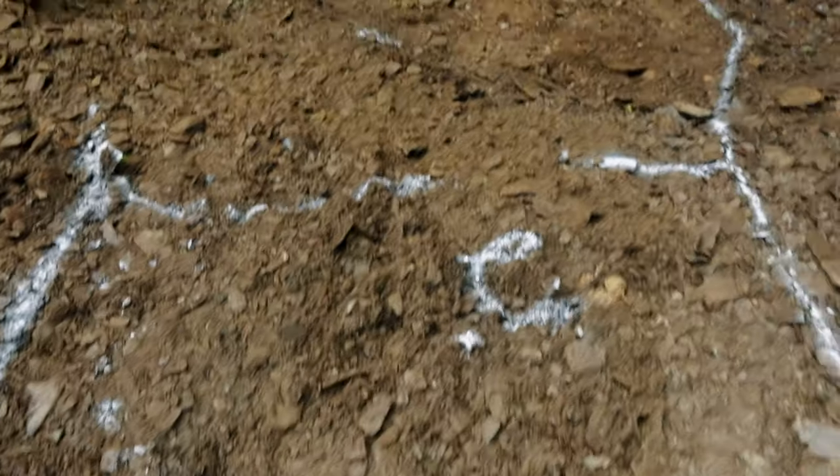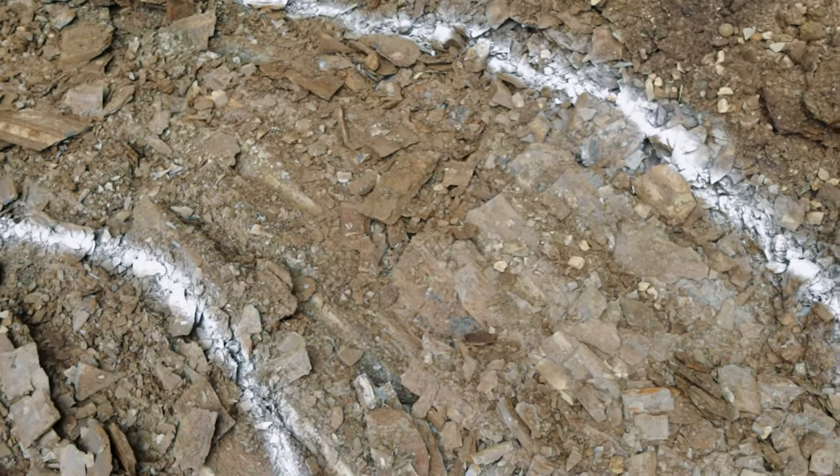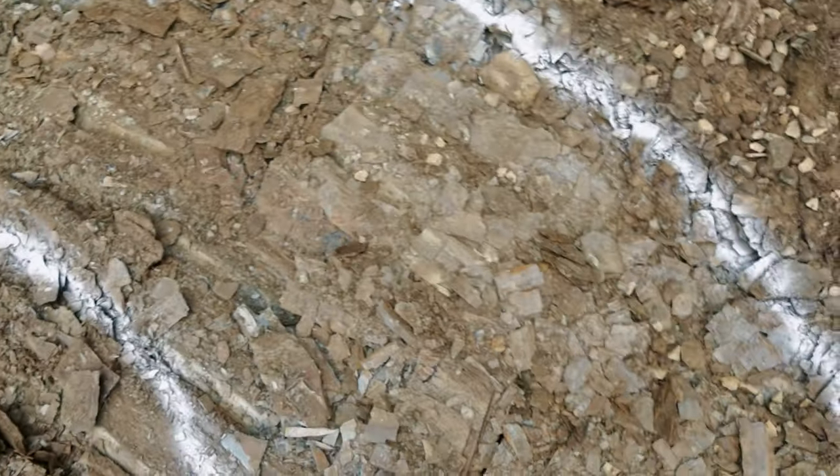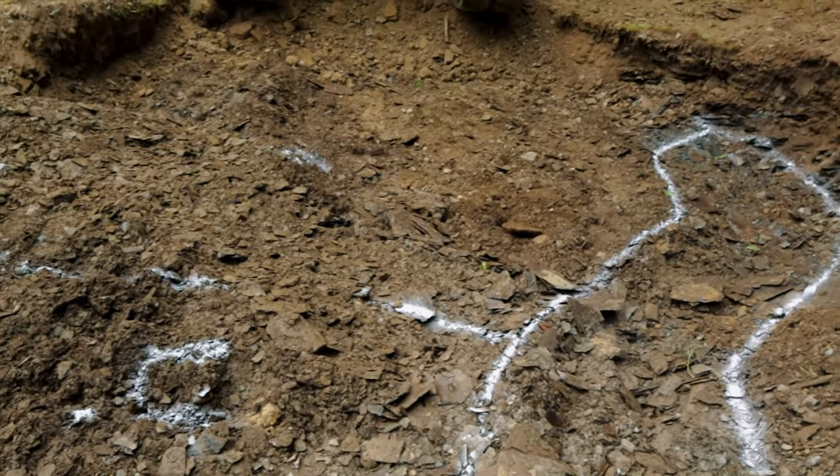From there, we're going to step down to two feet. Imagine there's going to be a couple steppers coming down in here — about a foot of water, 15 inches, and then two feet. So the dogs are going to be able to get in here and out nice and easy. Over on the far side, that's where we'll drop down to our three feet of excavation. We are hitting shale right now, so I'm actually over-digging. On top of this, we're going to use a stone dust layer — I'll show you what stone dust is in a minute. I like stone dust because it kind of holds its shape and has a nice soft cushion. That's going to go on top of this shale rock. Right now I'm actually able to scratch through it, but I've got to go three feet over there — that's where we might start breaking out the hammer. As I'm getting further down in the shale, it is getting harder and it's not coming apart as easily.